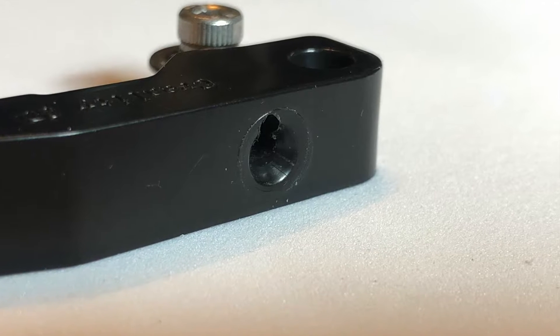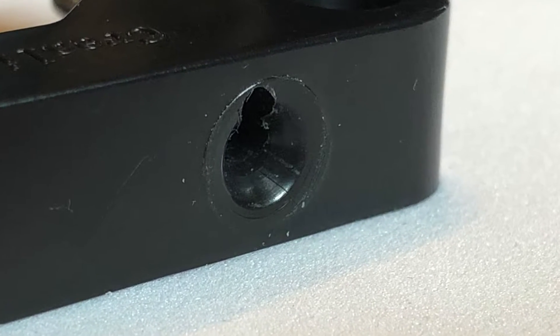Now let's talk about how this improves on the stock part. First, it's metal, meaning the filament isn't going to wear a deep groove in it as happened with the stock part — after seven months of average usage, that's a pretty significant groove. Second, the way the loading lever attaches to the stock part, you have to very carefully manage the tightness of the screw. If it's too loose, the arm is floppy; if it's too tight, the arm binds and the spring can't keep the idler bearing tight enough against the feed gear to consistently feed filament. On this new metal one, the lever hinges on a sleeve, so you're able to tighten that screw down and the lever can still move freely. Third, the spring that comes with this upgrade seems a bit stronger than the stock spring, and combined with the freely moving loading lever, I don't have to worry about filament slipping when it's supposed to be feeding.